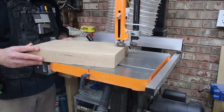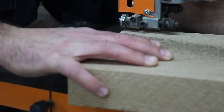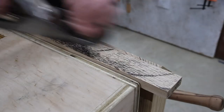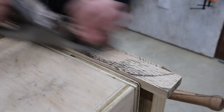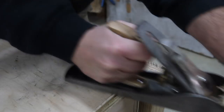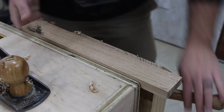For the bottom of the vise I'm making a wedge. In the previous setup I just used a piece of scrap 2x4, but this wedge is to keep the vise from racking. Jay and Wayne Brown both have the same setup - they both use a wedge - and I've yet to make one for mine, so I decided to go ahead and do it when I moved the vise over.